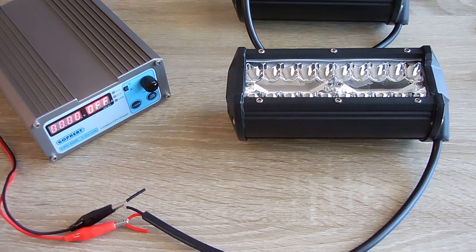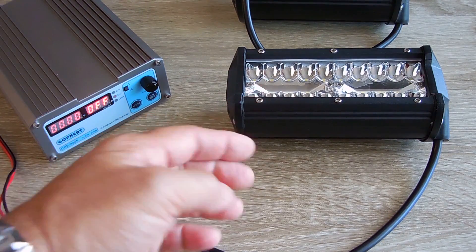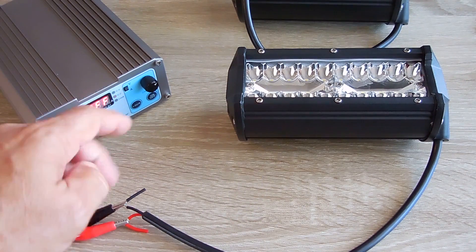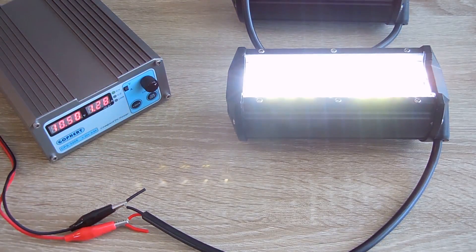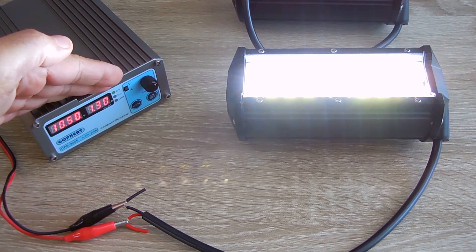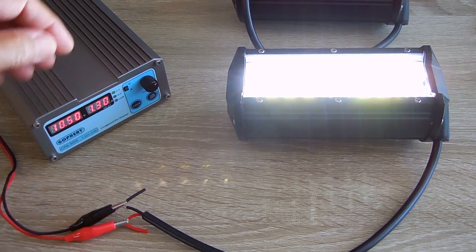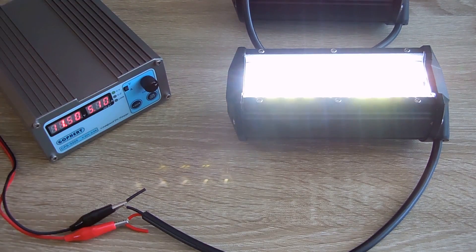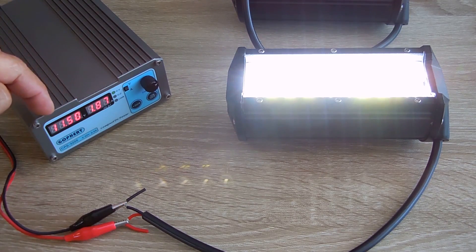You can see it right here in this demonstration. I'll turn it on — it'll be around 10½ volts. I'm going to increase the voltage slightly to 11½. You'll see the light get brighter, and then everything above that is going to be the same exact brightness, but you'll see the current level gets lower as the voltage goes higher. So right over here it's 10.5 and it's drawing 1.3 because it's not enough to get the whole thing going. Now I'm going to go to 11½ — watch the light.